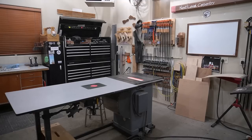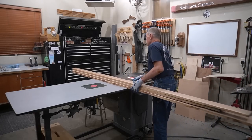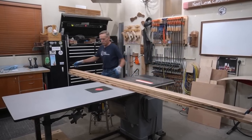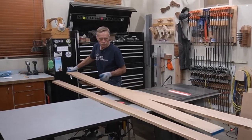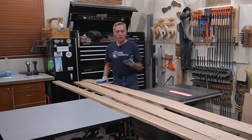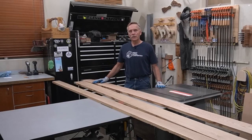If you decide to build a drying rack like this for yourself, or to build two so you have a gift for someone special, the first thing you'll learn is that even on a small project like this, it's important to start with wood that's flat, straight, and smooth. This fold-up drying rack can be made from virtually any species of wood from pine to padauk. Since the white oak I'm using was only available in four-quarter hit-and-miss thickness, I've got to do some pre-milling so that the boards I'm working with are exactly flat, straight, and smooth.